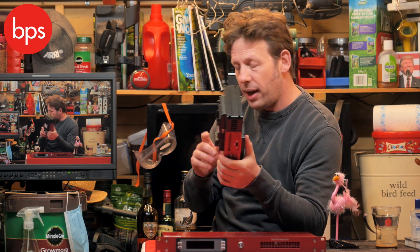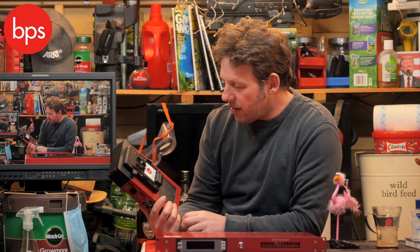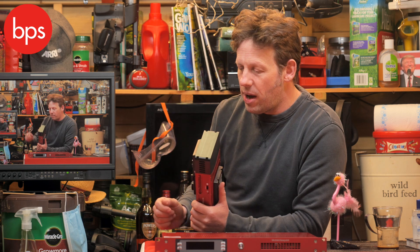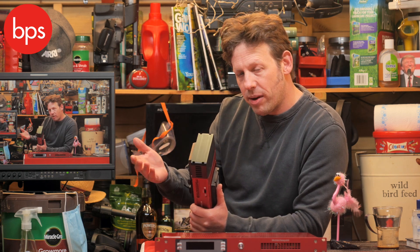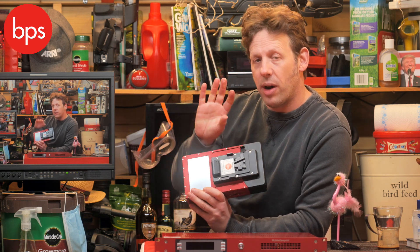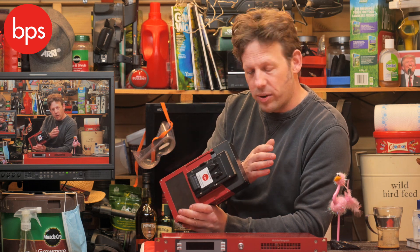The beauty of it is this is an H.264 and H.265 device, so you can transmit with either. The other thing that nobody tends to remember is that it can actually record internally. That means I can have three sources at any one time: I can be recording in my camera, recording a high-quality version in the unit, and there's the copy I'm transmitting at the same time. If there's an issue, you've always got your high-quality recording.